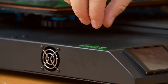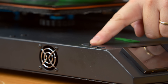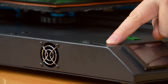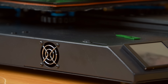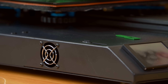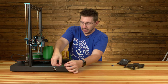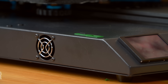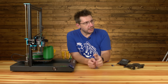Let's talk about some of the things I didn't like about the machine, because it's not perfect. This green bit right here is a plug, because when they first manufactured these machines there is a giant space around where the USB port and SD card holder are — that gap is big enough to fit an SD card. There were specifically three times I remember putting the SD card in the hole instead of where it should be. This cover is available on Thingiverse and was a four-minute print. Newer versions of this machine have the sheet metal cut to a proper spacing so you won't shove the SD card in there.